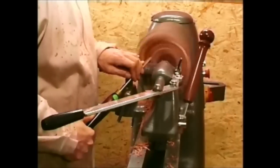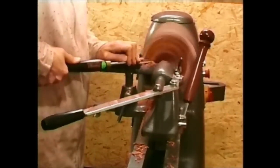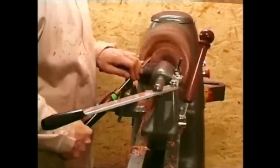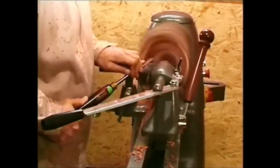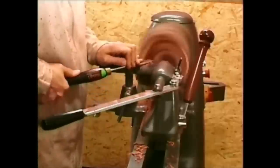The bevel will rub behind the cut whether I hold the tool like this or like this. As the tip rises, the shavings get larger and curlier. The finish improves. The wood comes away with less effort. I'm not saying that the tip up like this is the easiest way to use the gouge, just that the best results and the sweetest feel in the cut are to be found there.